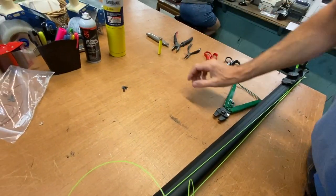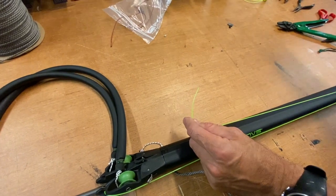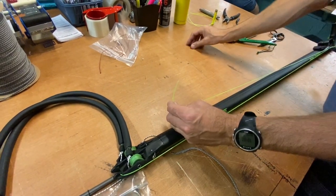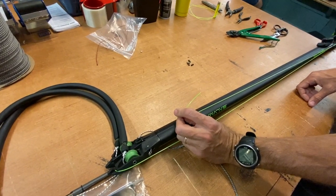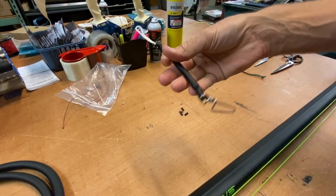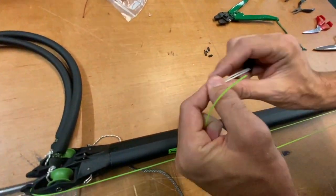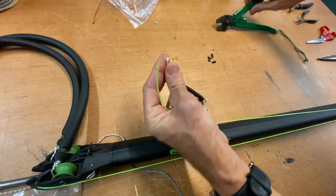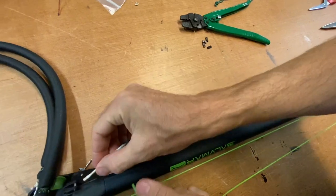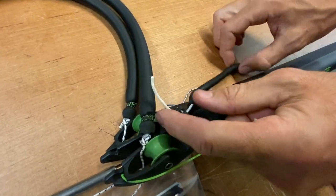So what we want to do is take your crimping pliers. We're also going to need a muzzle snap bungee, part number MA-1153 — a Maverick America product. This is a muzzle snap bungee with a stainless steel snap clip, about $8. Here's the trick for fitting these things to tight spaces: you can literally squeeze it and this is going to be your line anchor, going right in there. As you can see, that makes it a lot easier — it's generally really kind of tough to get it in there like that.